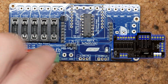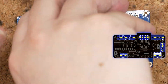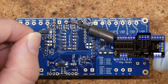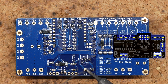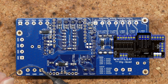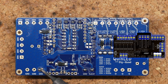Now let's add all the screw terminals. I start soldering with the easy screw terminals first, because as I said, these are only connected to simple lines. But some of the other terminals are connected to copper planes again. As you can see with the ground terminal, they are going to need a lot of heat to first heat up the whole plane, and then the reflowing starts to become easier. Keep your iron on there for a while — even minutes if you have to.